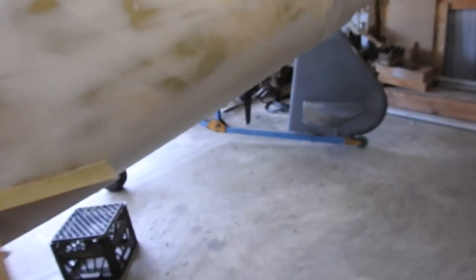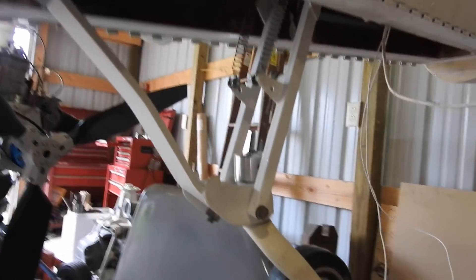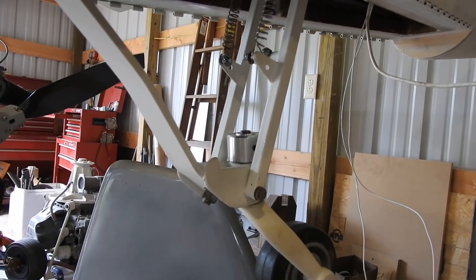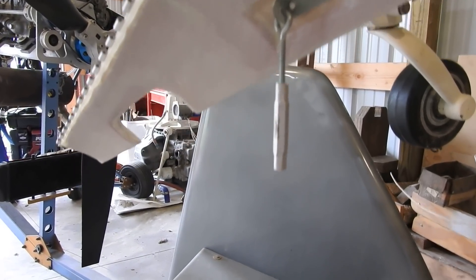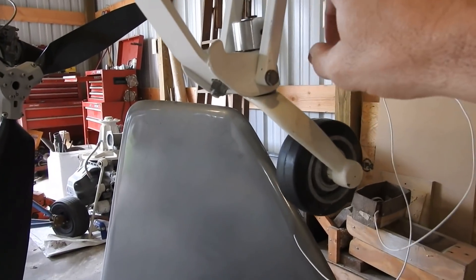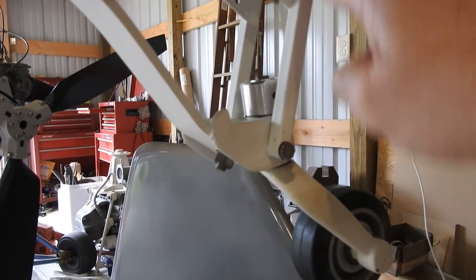The second thing I did was the tail wheel assembly. You can see I had it torn apart. Got that all done, got it all painted, put back in. Problem was these holes were in a bad spot. The little turnbuckles that pull the doors closed — this is one of the turnbuckles, the other end is off — those are hinged in with a hinge pin so I can take the doors off. The linkage attaches from here to the door, so I got that fixed and repainted it.